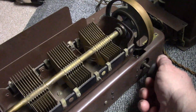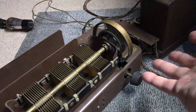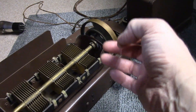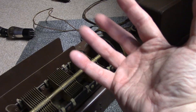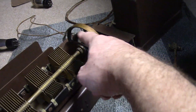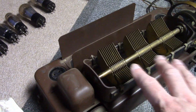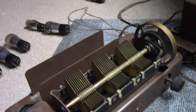Although this is made out of pot metal supposedly, neither one of my examples has any issues whatsoever. Pot metal is a term for a sort of random alloy — zinc, aluminum, tin, whatever scraps they had lying around melted down and put into a mold. Depending on the composition, primarily it's the tin that's a problem because tin can do weird things like form whiskers, and the alloy can start cracking apart over time. But hey, I'll take it. The odd color on some of the stuff is tinged with a bit of nicotine byproducts. Some of this is actually brass, so it's not like the aluminum is heavily tinted — just a little bit of a tinge.